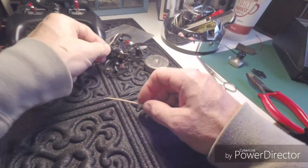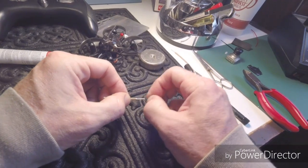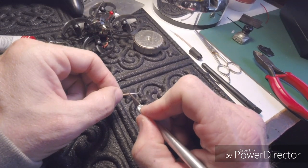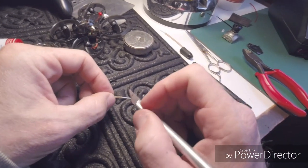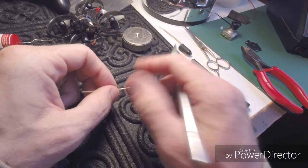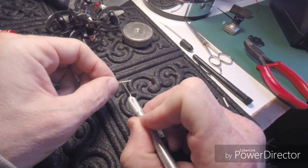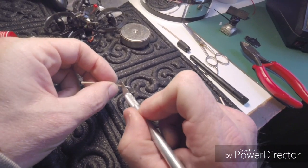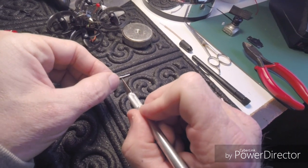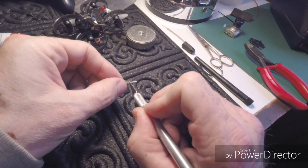This is how it'll come up out of the Mobula 7, just like this. Here is your vertical radiator coming out. Now right here, this has already been cut off a little bit because this is one I stole the shield off of. Your coating will come all the way up to the end. What you've got to do is take a razor blade and trim just about a sixteenth of an inch — barely trim the rubber coating off without cutting any of the shield wires. Be really careful and trim it off to where you have about a sixteenth inch of the shield wires exposed.